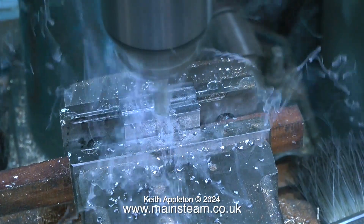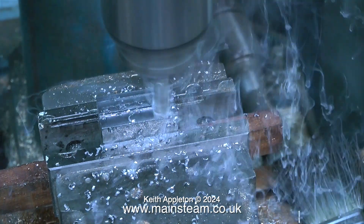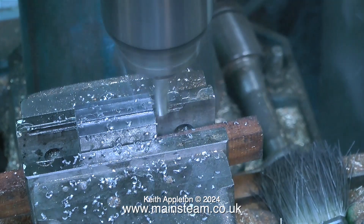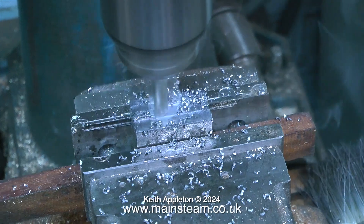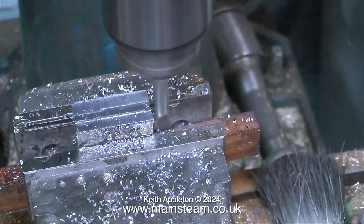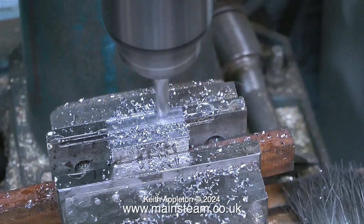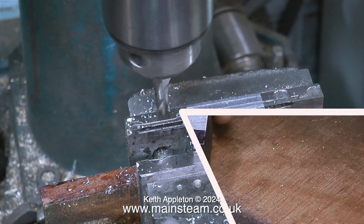Although at this point I must add that if I was doing an important piece of milling, like on a casting, I would probably use the milling chuck. This is quite a nice effect — it looks like something from a science fiction film. All I've done is put some three-in-one oil on the top surface, and as the metal chippings coming off the steel are very very hot, the oil smokes just like you can see here. The effect is even stranger if I speed up the video.